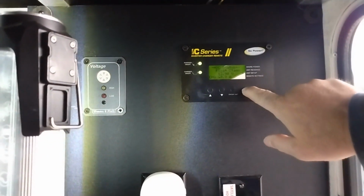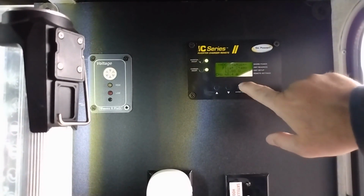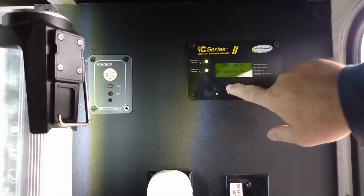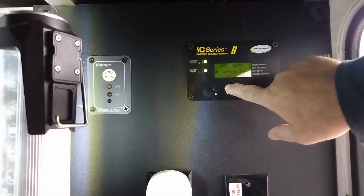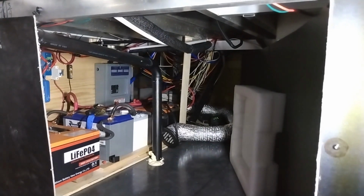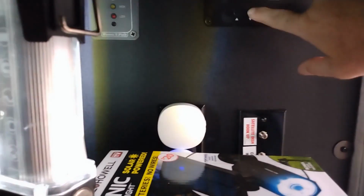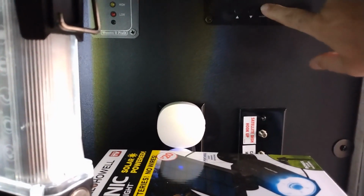So first, let's lower our charge rate. I've already turned the front solar panel system off. I'm going to be going pass-through power. I'm going to jump over the other batteries, actually the other 5 batteries. I'm just disconnecting that one, but I don't want a lot of current going into it while I'm messing around with it.